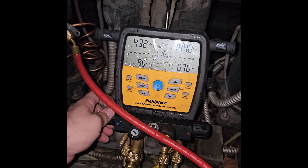For whatever reason, we don't have clean power up here. There are convenience receptacles on a bunch of the ACs and they're not getting the right voltage. I reset all the GFCIs and we're getting like 89 volts for some reason — something's funky with that. I hate to have to do this, but I had to use my cheater cord, or my widow maker. These aren't the safest things in the world, but sometimes you got to do what you got to do.